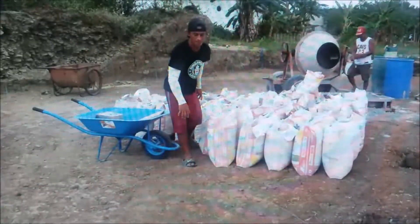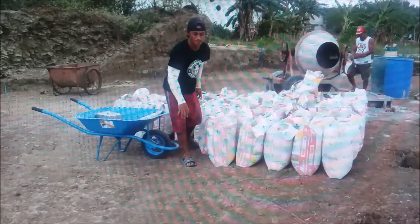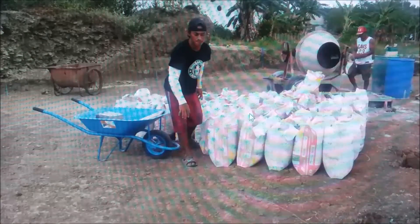Over here on the left are the teeth that don't wear. These over here are worn because they're near positions where the mixer is at different parts of the mix cycle — like charging, mixing, adding more water if needed, turning to dump. The other teeth just go across once per bag. This mixer has done maybe 3,500 bags, so that's just something that wore out.